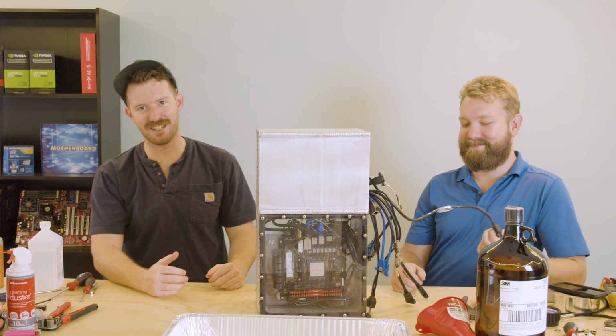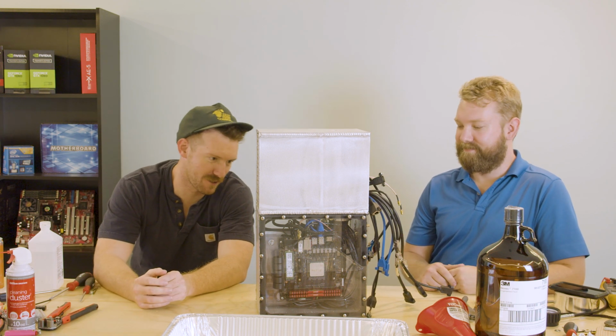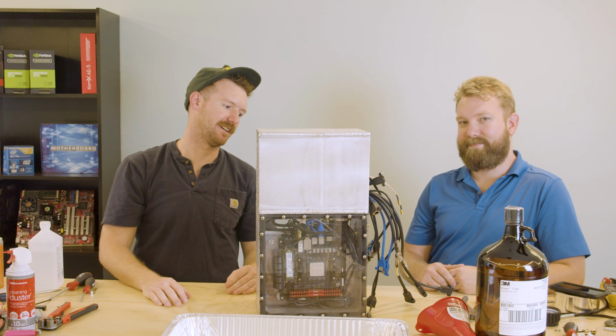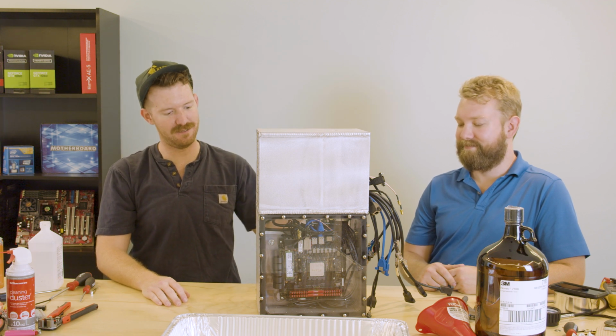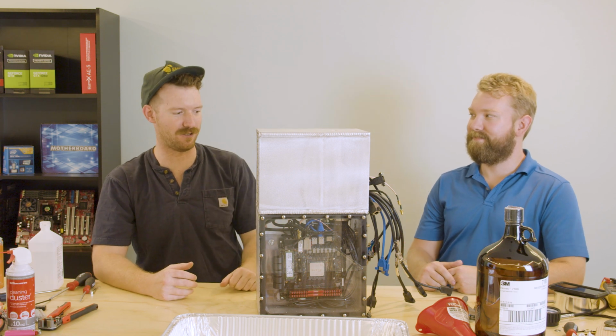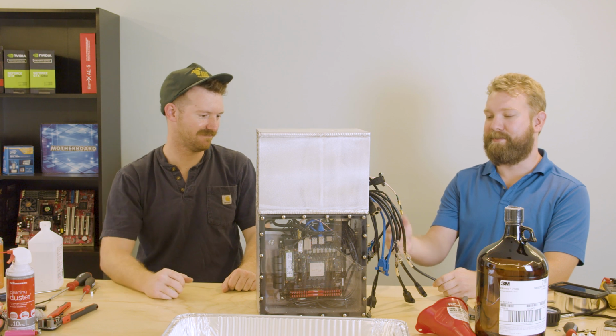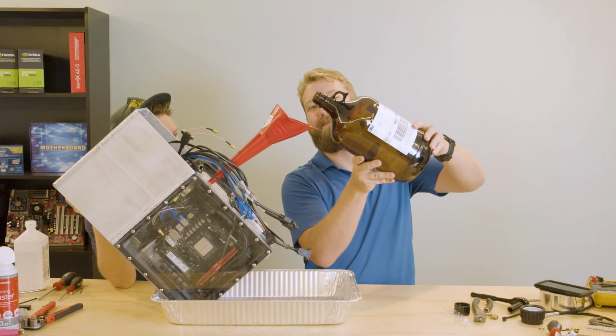So our epoxy sleeve method seems to have worked because it's holding pressure now. We pressure tested it one more time, and it leaked a little bit out of the side, but then it seemed to stabilize at 7 psi, which is about the highest it should go. Yeah, basically that's all we needed to do. It's time to fill her up and seal her shut.